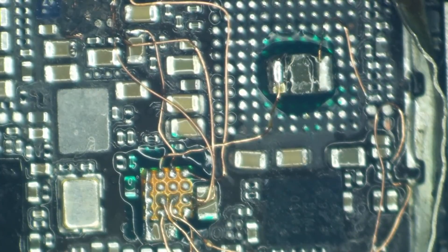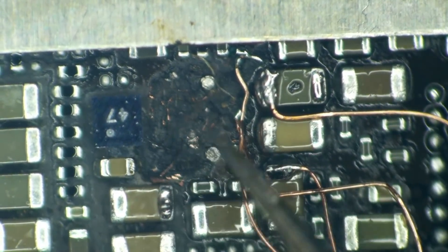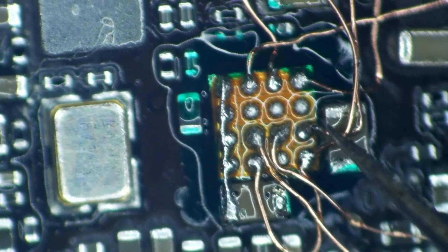Right now this board looks like this. In the spot where we would normally have the IC that creates VDD boost, we now have a charcoaled hole with little visible hairy gangly snaggly trace things sticking up that have no business being on top of the logic board. This chip, U2301, is actually supposed to go here, but to get this working I mounted it upside down over here, and with that I managed to get the data off of this board.